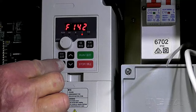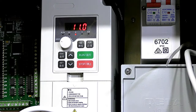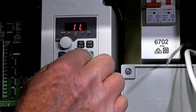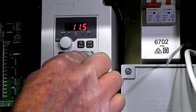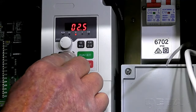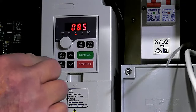Registry 142 is the maximum amperage. That's wrong — it should match the motor nameplate. The nameplate advises 8.5 amps. So we're going to put 8.5 amps in there. We could have caused damage with the wrong value. Set to 8.5 amps as rated on the motor plate.